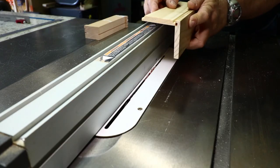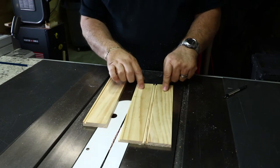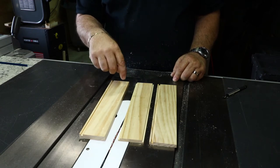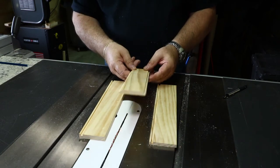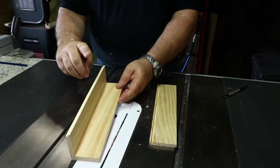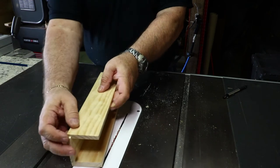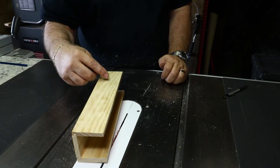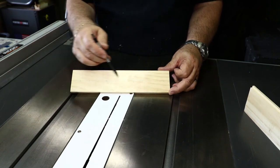I've got a good friction fit on the top part and the base. The pieces are: two and three-eighths inch thick by two and a half inches wide for the base — the heaviest piece — and half inch thick by two and a half inches wide for the other parts. I'll drill a quarter inch detent in the base for the pen tips to rest in. The middle piece has tongues on both sides and slots into the base, with another tongue for the top piece. The top piece is where I'll drill the five-eighths inch holes to hold ten pens, then cut it in half to give me racks for two pen sets.